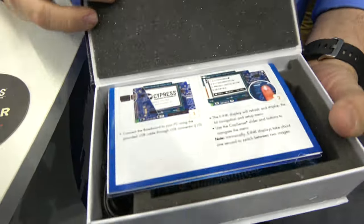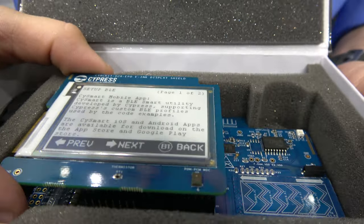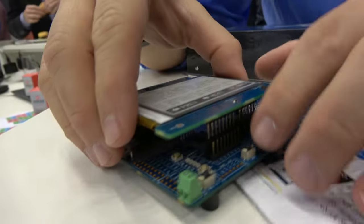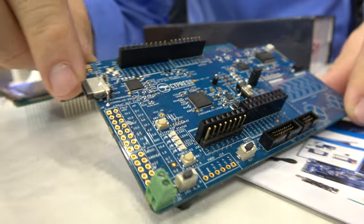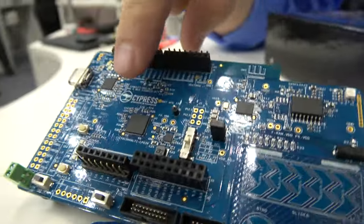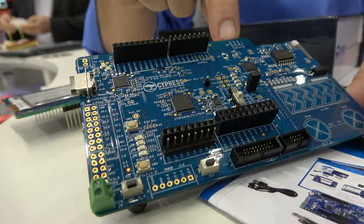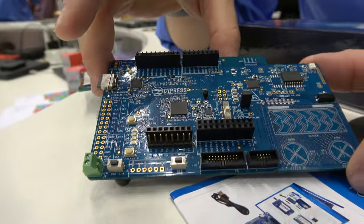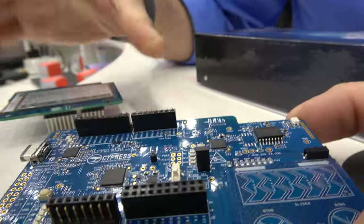On this hand I have another first unboxing — this is our development kit. Following our low-power consumption story, we have an e-ink display. This is our Arduino form factor kit, and another first: this is the first kit that ships with USB Type-C. We have our programmer/debugger PSoC 5, and right here the PSoC 6 with a PCB on-board antenna for Bluetooth. We have memory, capacitive touch user interface with slider and buttons, and a super cap on the back to complement our low-power story. The display that comes with it is an e-ink display.